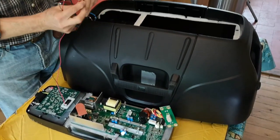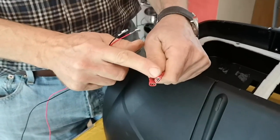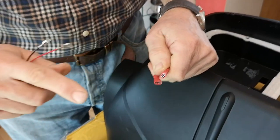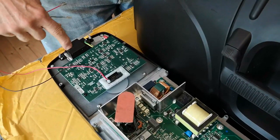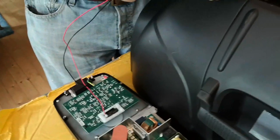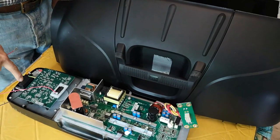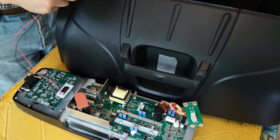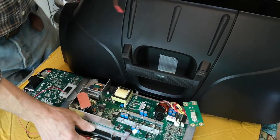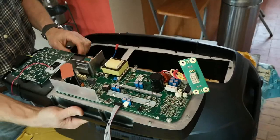Moving to the actual enclosure, check that you've got a small crimp and a large crimp on the end of the mains power supply wires. Some of them have got two large crimps, and if the crimp on the back of the fuse holder is smaller, the large crimp will be a little bit loose. So check to make sure these spade terminals are a very good fit.